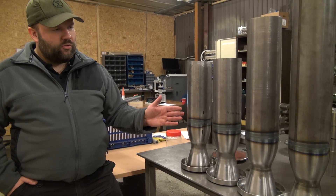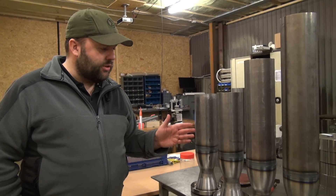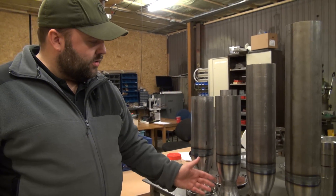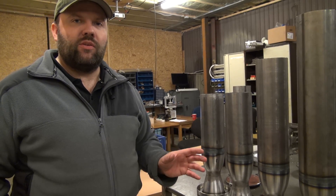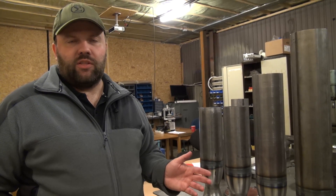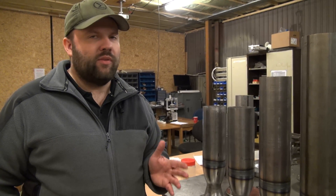The outer one is simpler. Don't mind the length — that's an experiment with different specific lengths of the engine. What's new and very interesting about these is that instead of a normal metal-shaped or metal-spun raw material, which was a one-piece construction, we now have several different pieces manufactured by CNC machining instead. Usually these CNC machined parts can't be very long or very big because you can't get the tools in and you can't get the swarf out afterwards. So we simply decided we are going to try to weld these pieces together.